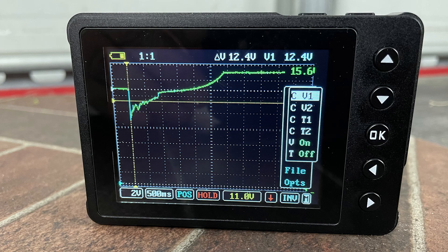And if it reads 10.5 volts or less, don't even bother. There's at least one dead cell in the battery and it needs to be replaced. Let's compare that to the waveform we captured the last time we were together.